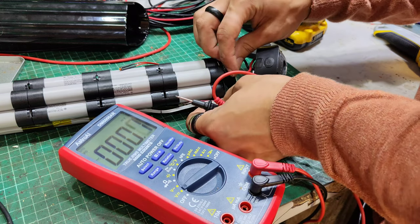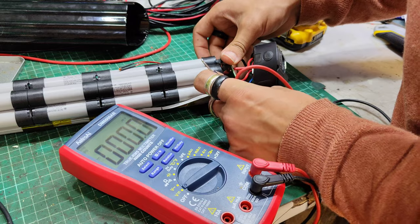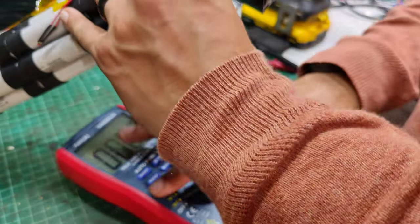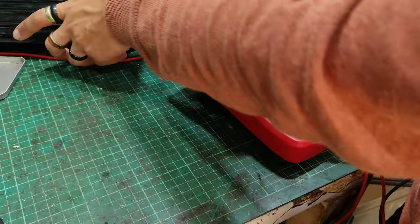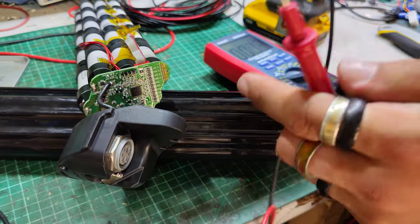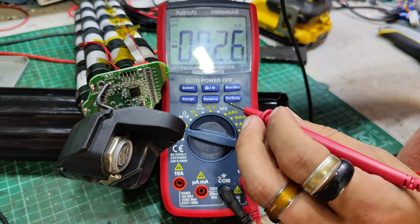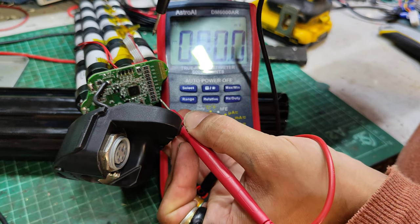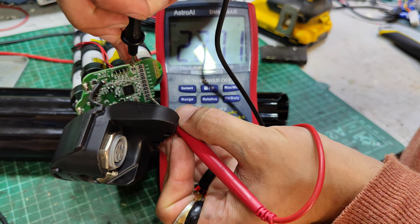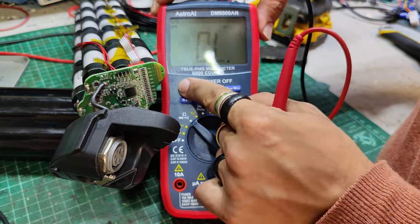This is bizarre — not something I'm really familiar with at all. If I could check the voltages across the resistors here — I don't know what is the ground, but we could find out. Two point three volts across there, twenty-two point one across there. So this would be our negative. So if we go for a continuity test.